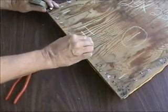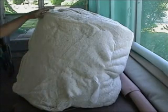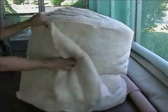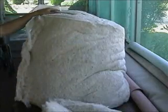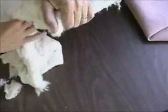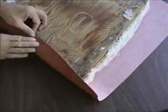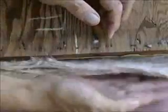Place a mark in the center of the front and back of the plywood frame. You can use cotton batting like this or a bonded Dacron polyester wrap like they use for quilts. Take off the excess padding even with the bottom edge of the plywood. If you go over the edge, you may get tack pulls, which are bad-looking indentations. Line up the center of the seat with the new cover.